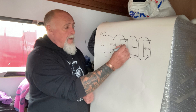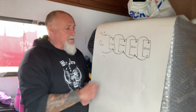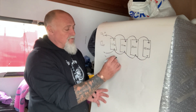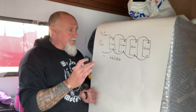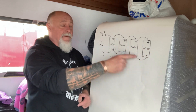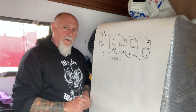These 110 amp-hours - which is the amount of current the battery can deliver over a certain number of hours - is added up. So four 110 amp-hour batteries would give you a battery bank capacity of 440 amp-hours. That's batteries connected in parallel: the voltage is still 12 volts, the current is shared between the batteries, and the amp-hour capacity is summed up.